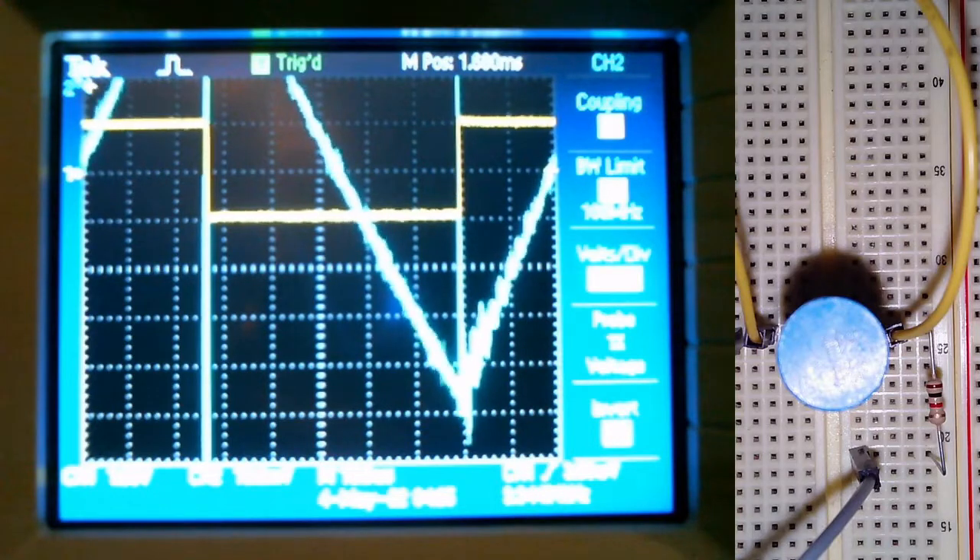So as you can see, I did indeed prove that this waveform coming out through the inductor - what I was presenting on the board - wasn't just making it up. It's actually what's happening across that resistor through the inductor. Hopefully you enjoyed the video. If you've got questions, go ahead and ask them down below, and I hope it helped you understand the very basics of buck converters.